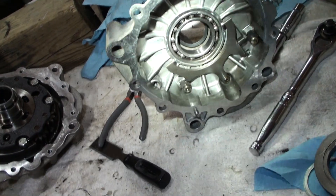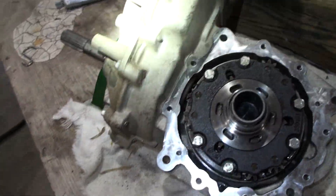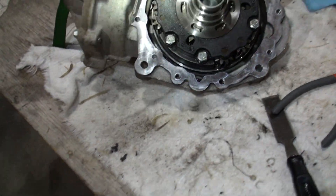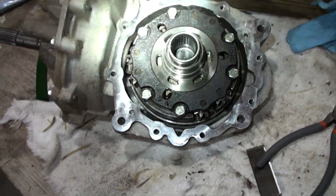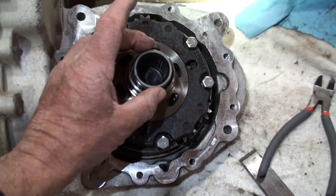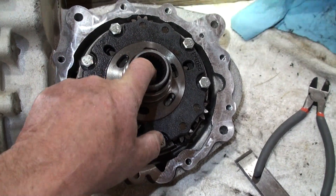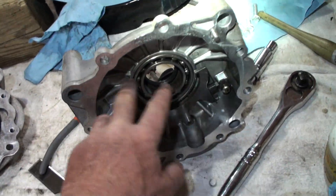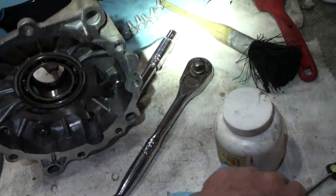There's really not much to it — the bearings all look good. This just slips right out, all these gears look perfect, and inside here it's all nice and tight. I really don't see a problem at all with the transaxle. At the 130-hour mark it should still look like new, and it does. So whatever this weird issue is, it's not in the transaxle, even though that's kind of what it felt like. It felt like there was a lot of play in these axles. They do have a little bit of play right here, but it wasn't the bearings moving — it was just the axle inside the spline which had a little movement. So when you play with it, it was really hard to determine. I thought the bearing itself was moving, but the bearings are just fine.